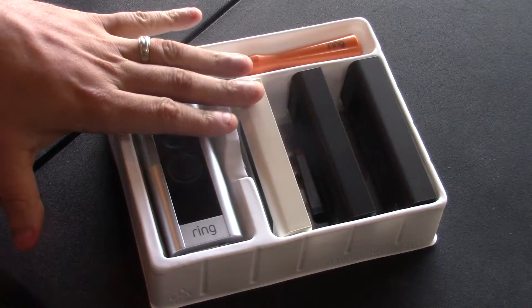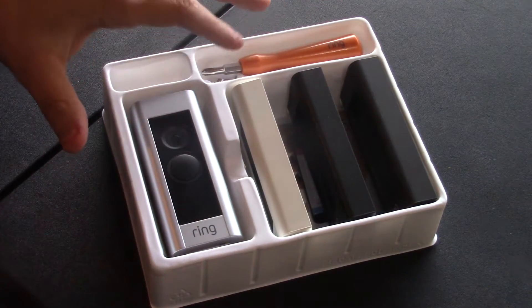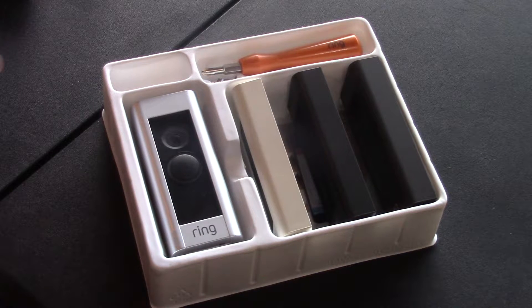They claim that everything you need comes in this kit, and that's true to an extent. You get the different face plates, the screwdriver, the wires, the power pack, and all that. What they don't tell you — or maybe they do in the description — is that you need a 16 to 24 VAC transformer for this to operate. It's not battery operated, it's hardwired. My transformer was 11 or 12 VAC and it just didn't cut it. So I had to go purchase a new transformer. Just type in 'doorbell transformer' — I paid $14 for it, and it literally took me two minutes to hook up. But you need more power for this than what you did for the first generation, so be aware of that.